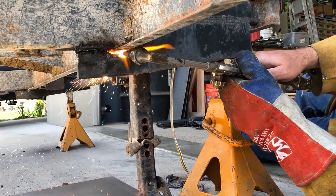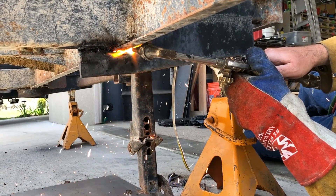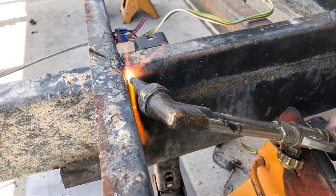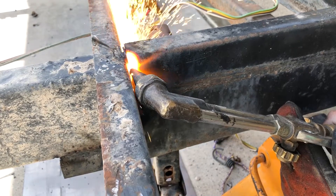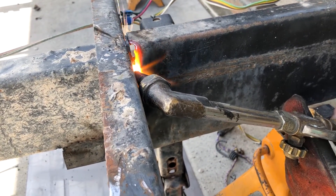Starting with this, I'm going to start on the edge where it's open — the metal is going to get nice and hot really quick. Doing a vertical cut, I'm just kind of preheating the steel. You can see starting on the top when you're doing a vertical, just going top-down, you're kind of letting gravity do some of the work for you.